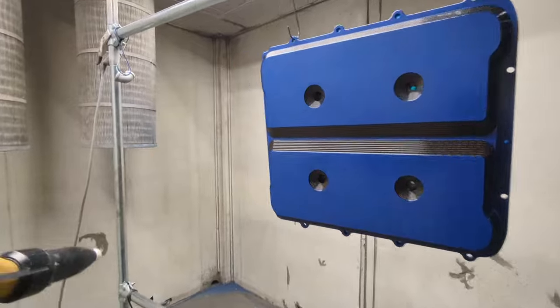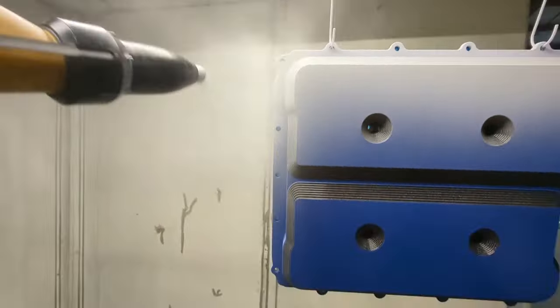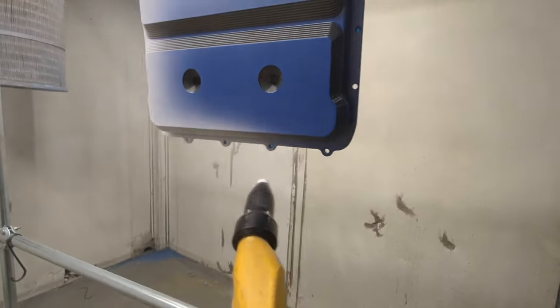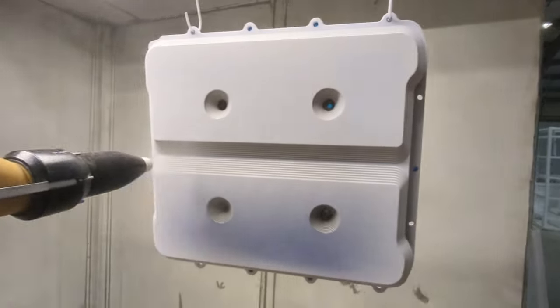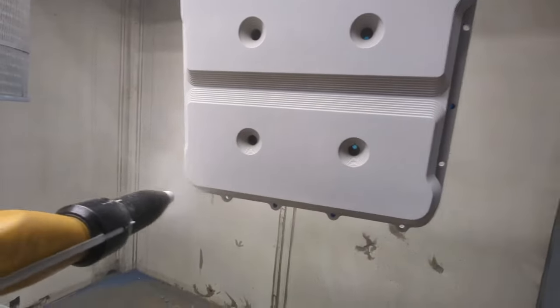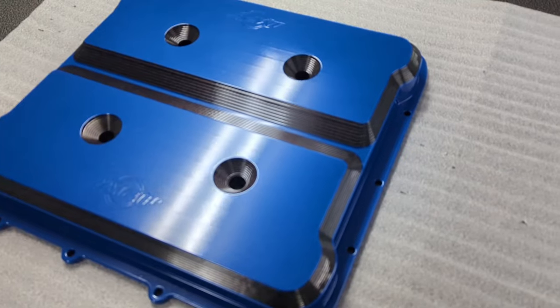With Prismatic Cosmos, I tend to do a little bit more than just a flow out. I'll get it to full temperature and give it a couple minutes. It seems like with Prismatic Cosmos and some of these other ones, when you don't cure them long enough and you clear them, the clear messes with the flake. So, this is Tiger's Bengal Clear.